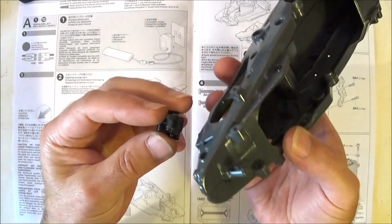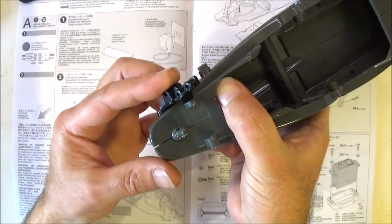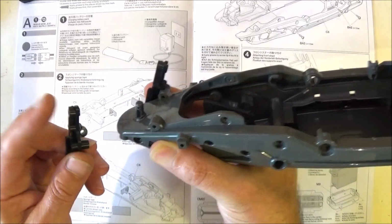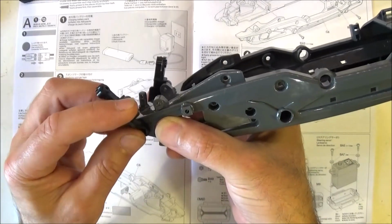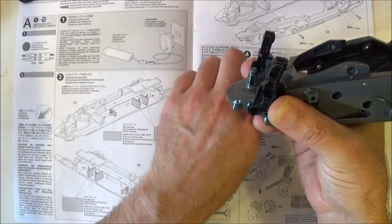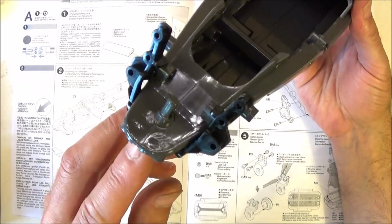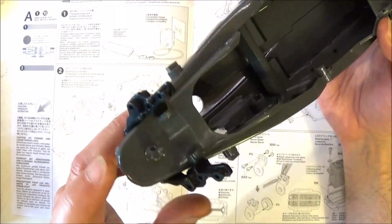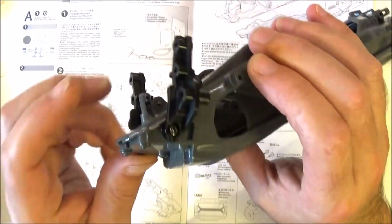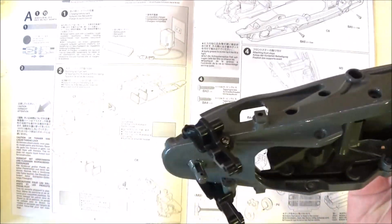They fit on the front here like so. That one with the 12mm screws, and then this M3 goes in there like so. So I'll just make those, remembering that the longer screw goes in the bottom here. So there we have step 4 finished. They've attached very tightly. I think that bottom screw goes through the middle there and holds the front together. I think that's why the longer one's there anyway. Okay, so we'll put this aside for a sec.